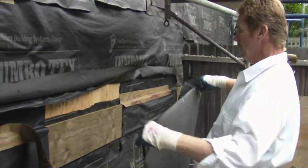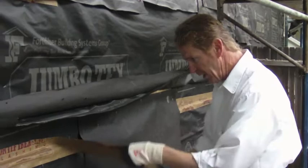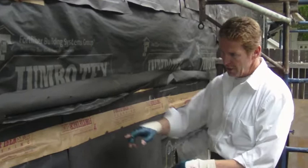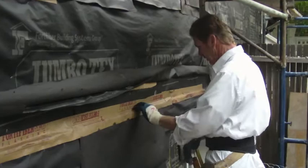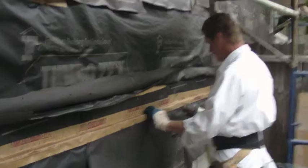Here's the belly band — they used a pressure treated piece of wood. What I'm doing is covering this piece of wood and putting on a second piece here. For a homeowner, I would recommend a Grace product — it's a peel and stick. You put it on the wood above and it acts like a Z-flash, coming down past the band and tucking it in.